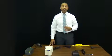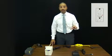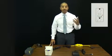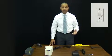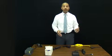If you plug an isolation transformer into a GFCI receptacle — those are the receptacles with a little red button in the middle, normally seen in wet areas like the bar area or any service area where you're mixing cokes and ice machines, or the bathroom, anywhere there's water — it's supposed to, if it recognizes any inconsistencies in the power coming in and out of it, remove the power. That's the way it's supposed to react.